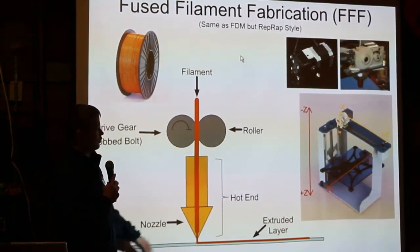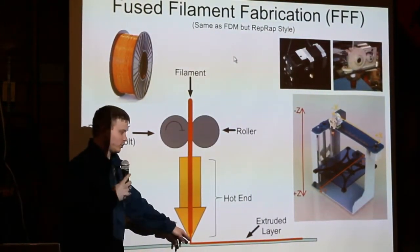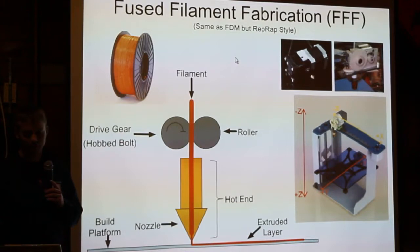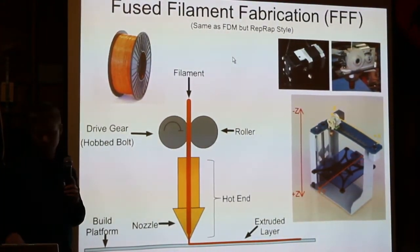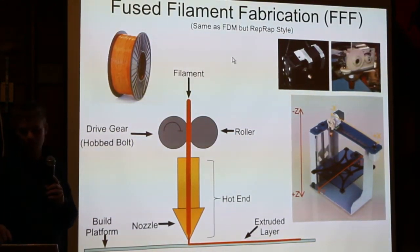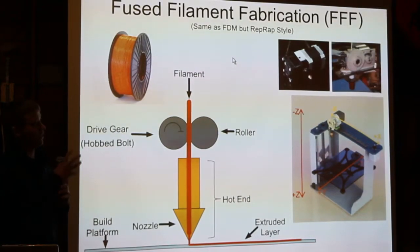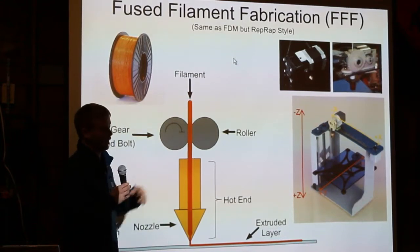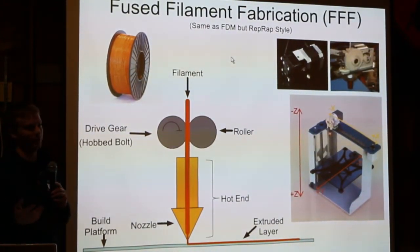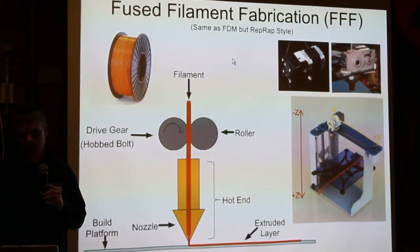You can move the nozzle in X, Y, Z directions. It moves around and draws one layer, then moves the nozzle up just a little bit, and draws another layer on top to create the final 3D printed object. The pictures up here on the top right show an extruder that MakerBot sells, and another popular design called a Wade extruder with a giant gear to give the motor extra torque to force plastic down through the hot end. It really is just a hot glue gun that moves around very precisely — there's no magic to it, you just have to figure out the mechanics.